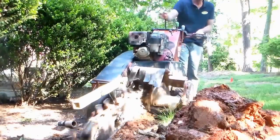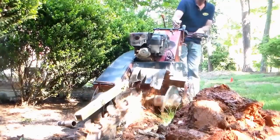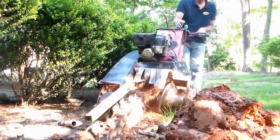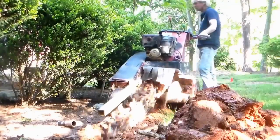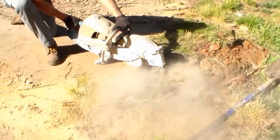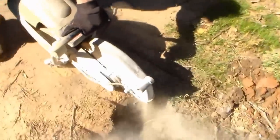We're going to start trenching here in the back of the yard. This is a project that the homeowner could do themselves. The magnitude of the job, the length of the job, doesn't really matter. The secret is to keep working. We have a crew of three guys here. It took us about four and a half hours to complete. While I'm trenching, I've got one of the guys started on cutting the asphalt drive. We are using a partner saw, a concrete saw, with a diamond-bit blade. It works just like cutting concrete, but asphalt's a little easier.